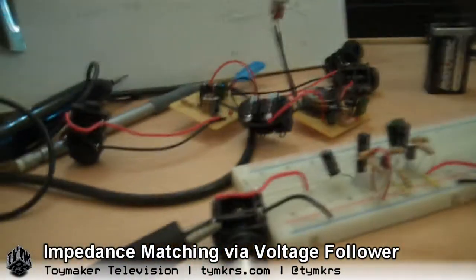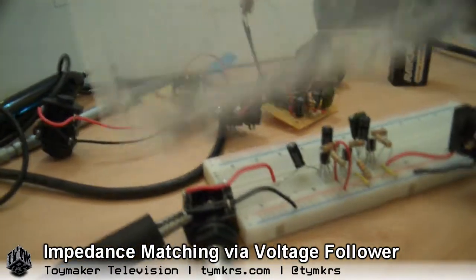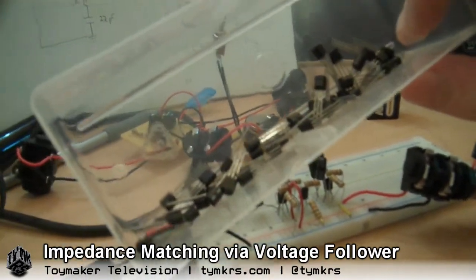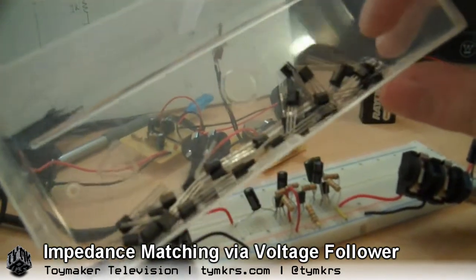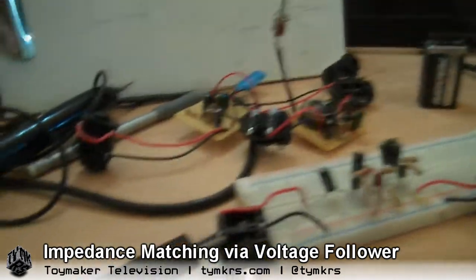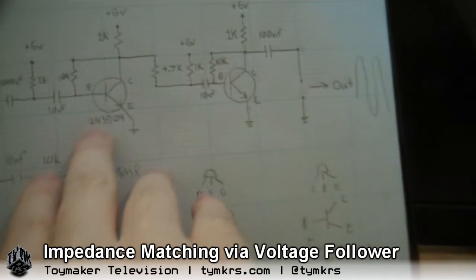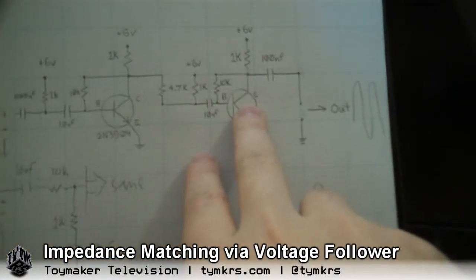But I don't have a whole lot of JFETs — we only had one. I do have a ton of these NPN transistors, so I wanted to come up with a way to build something just as good using these. We have used these in the past on our cascade preamp here — it's got two 2N3904 gain stages.